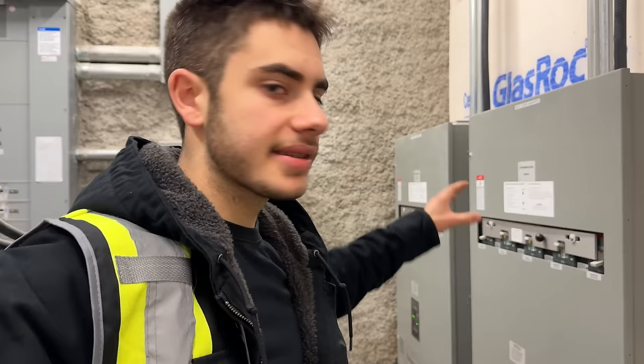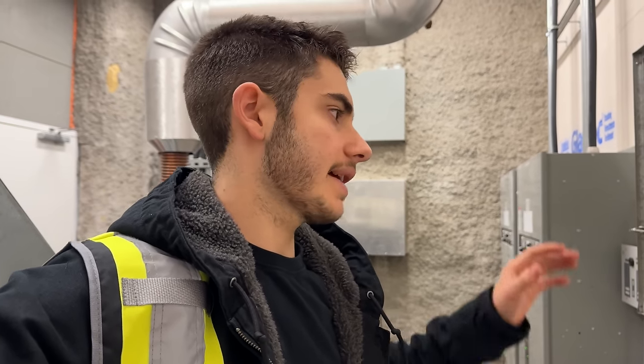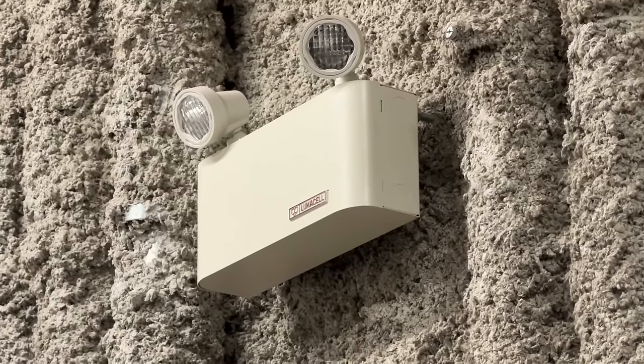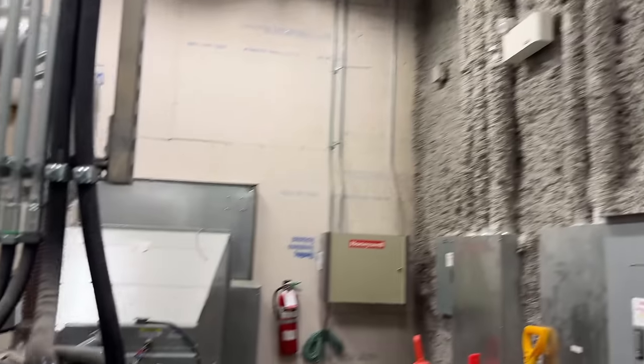I'm going to have two cameras. I'm going to replicate the power outage by shutting off the power that feeds these transfer switches from the electrical room, and I'm going to have a camera in here and one in the electrical room with me. Both this room and the electrical room have lighting on emergency power, so the lights in here will go out for a bit, as will the rest of the emergency lighting in this building. We're not shutting down the whole service though, so any non-emergency lighting will continuously stay on. This room and the electrical room also have battery-powered emergency lighting to come on to illuminate the space during the period of the generator starting.